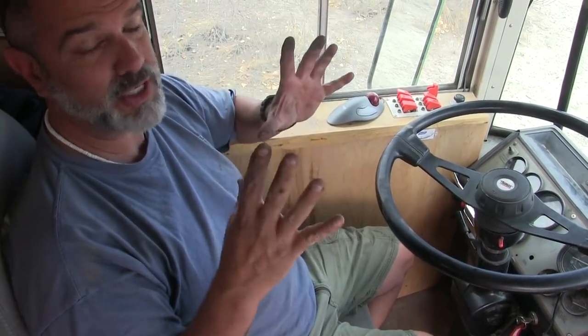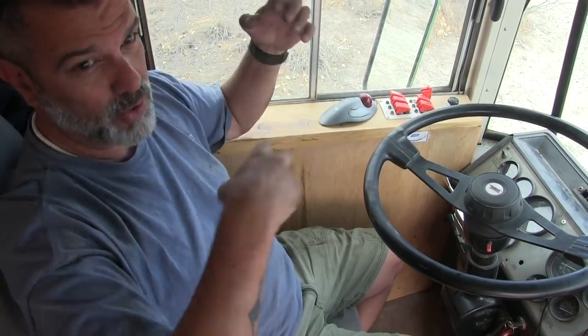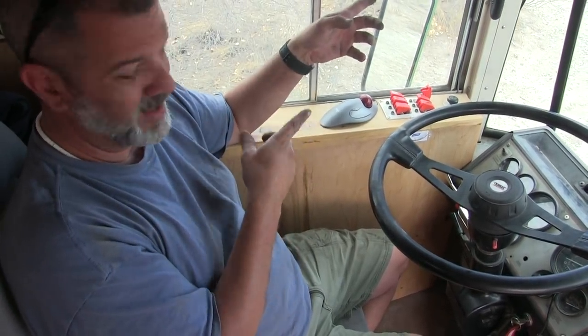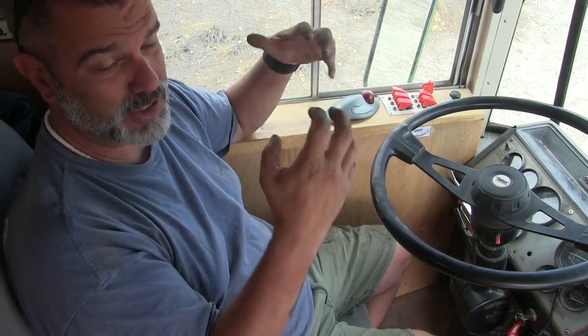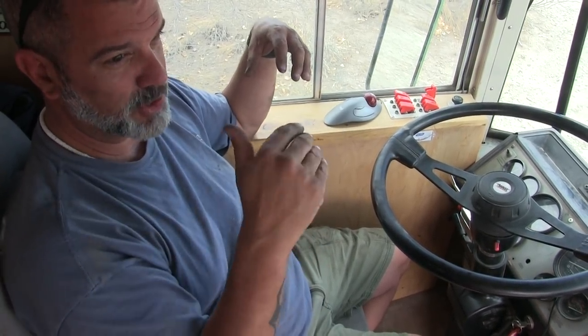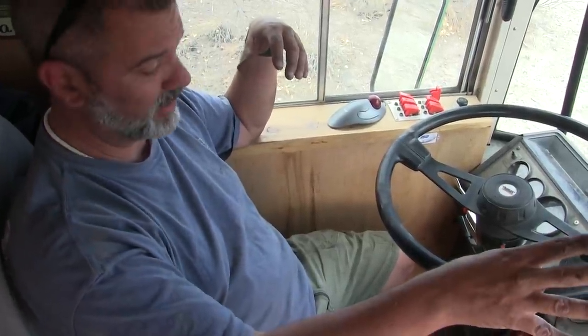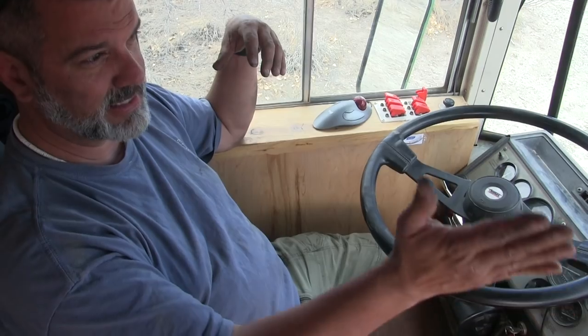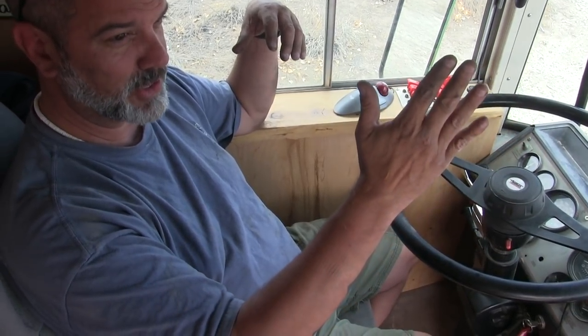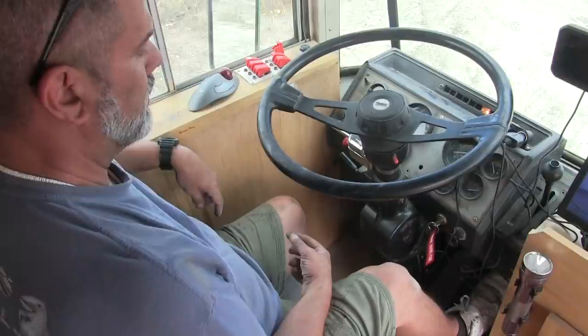The compressor on the engine is always spinning. The pistons are always going. It's not like your air compressor at home that turns off. This is constantly going. So the way they regulate pressure is when it reaches a certain pressure, they just allow it to bypass out of the D2 governor. When it gets down below a certain pressure, then it allows the pressure to build again. So that's the only way. It's all mechanical.